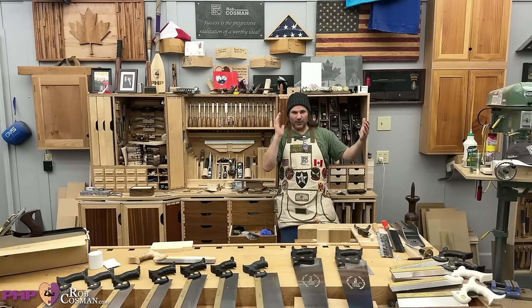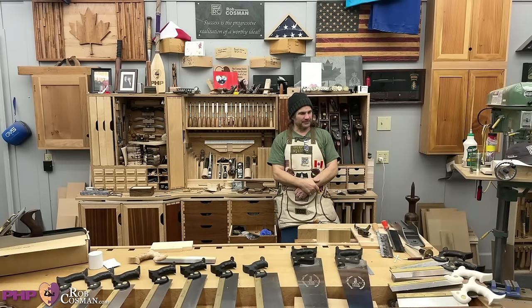Although it fit perfectly dry, now you put some glue on there and it starts to swell and it doesn't work the same. What I used to do was assemble it halfway and then go in and glue this half and that half, and hopefully it would go together before everything blew apart. Instead of trying to move it 12 inches, you're only having to move it 6. What are you gaining with it? I don't think you're gaining enough to justify the work.